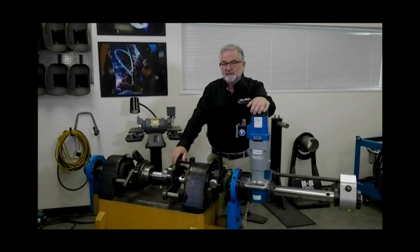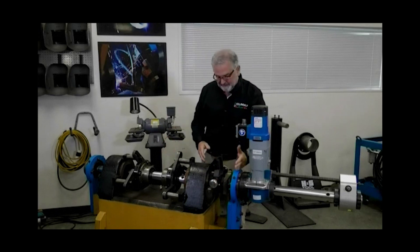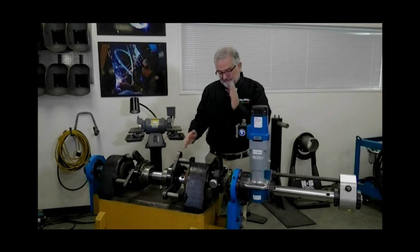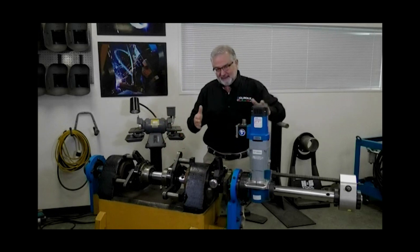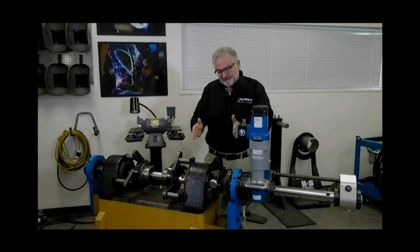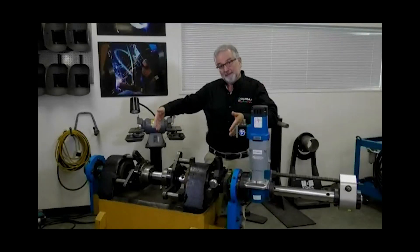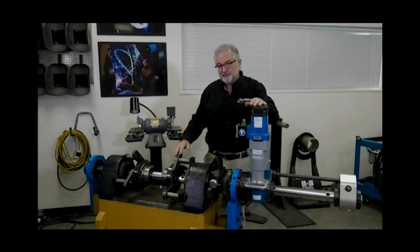So let's go right into this. Why would I need a facing attachment? That's this unit right here between the bearing and the workpiece. I would need that if I need to make that face perpendicular to the bore. Say this got damaged in use — this takes a lot of side pressure — and I want to make sure that this is nice and clean and a certain dimension overall. Because oftentimes I have something else that's going to pin to this and I want to make sure there's a good fit, or I've even got bushings, spacers, or shims in between.